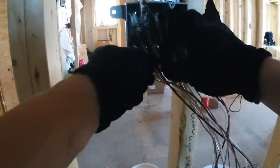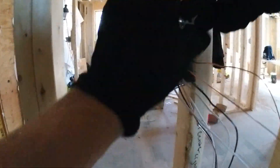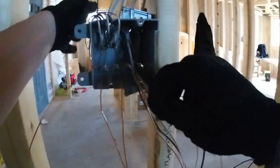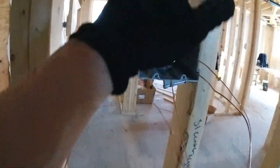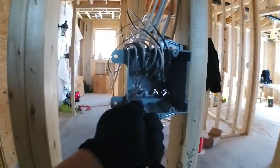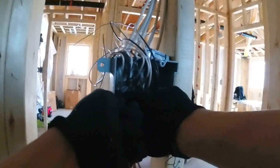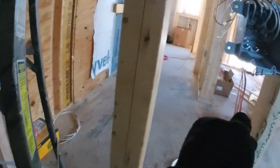You see I've got a quarter inch of insulation sticking through the box — that's a code requirement. One downside of stripping with a knife is the sheathing looks a little frayed; an NM stripper makes a nicer clean cut. But it's all preference. My second method for cutting in the box is to fold all hot and neutral wires out of the way first and go straight to the ground wires. For bigger boxes I'll pound a screwdriver into the stud to hold them out.